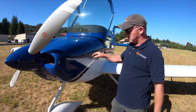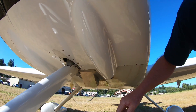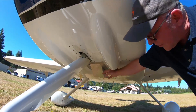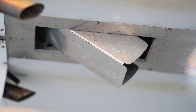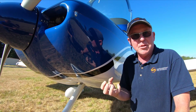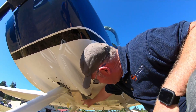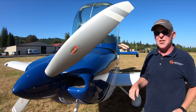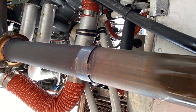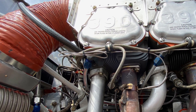From the outside, there are a couple of changes you can see. The main visible one is that it has these bumps down here now. Instead of having a center exit ramp with a square on it, these bumps are where the exhaust is actually riding. Back here you can see what we call a ramp flap — it's not in the cowl itself. The ramp is closed off but has a variable exit area that you can open for cooling purposes and in climb. The 390 and 390C engine is a pretty hot running engine; the oil cooler picks up a lot of heat. So one of the changes we made with this tuned exhaust was to change the cowling exit area and add the ramp. We also increased the baffle duct to oil cooler assembly — it's the same oil cooler, but we've gone from a four-inch scat tube to a five-inch tube and opening in the rear baffle, pushing as much air through that cooler as it is capable of allowing.